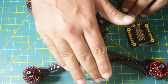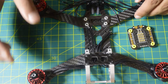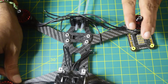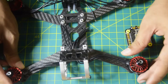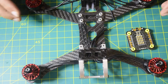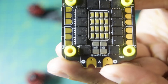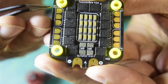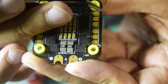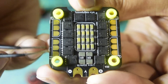This is the front side of the drone and this is the back side. The back side left motor is motor one, then motor two, the back side right motor is motor three, and this is motor number four. That is how we know which motors are installed at which place, and this has to match with the numbering on the ESC. As you can see on the ESC, it is clearly marked as motor number four, three, one, and two.